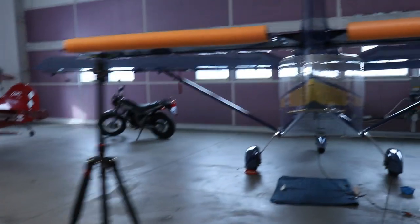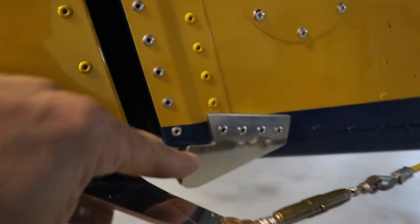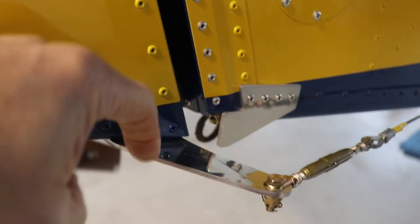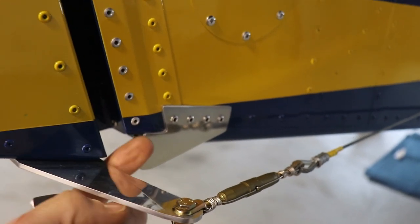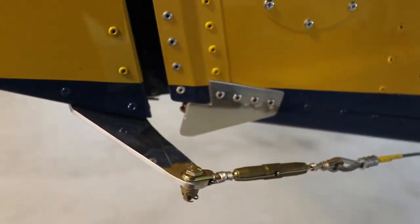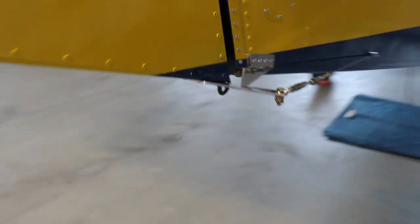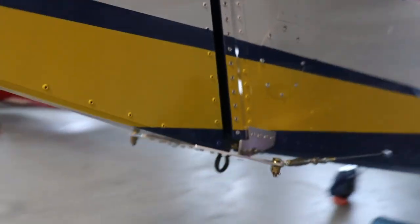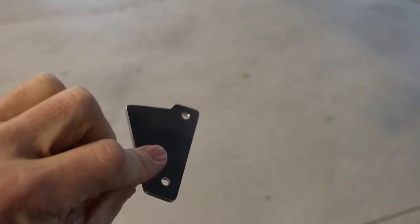You can see I've done that on my cruiser with these pieces here. If these were painted, every time you go to full rudder travel, you're going to start chipping the paint off and it's going to look bad. So I just polish these instead of painting them — the nice polished look gives it some contrast, it doesn't have to be painted, and I don't have to worry about the paint chipping. That's the same thing I'm going to do with my elevator down stop.